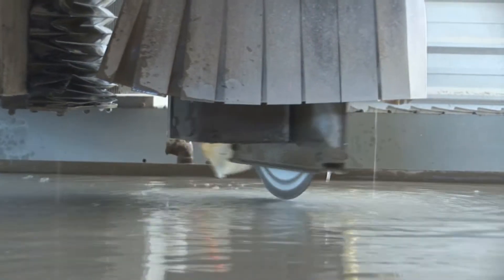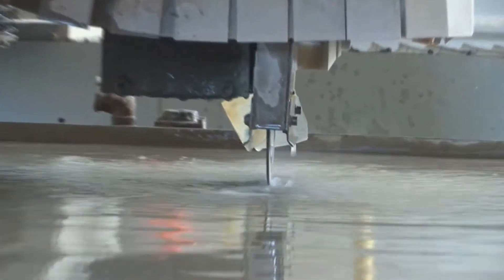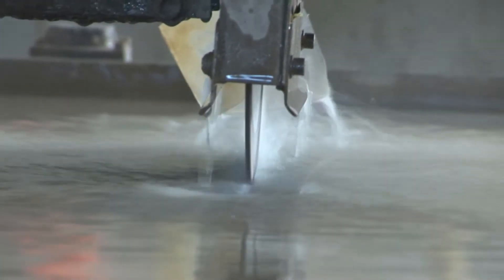As you saw when I wrote that program, it's going to take us about 16 minutes to cut up this entire slab. That's bullet fast — it would take us three times that long on a conventional bridge saw or water jet.